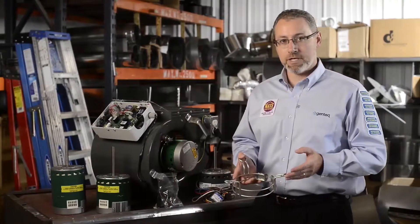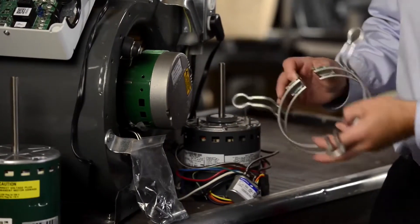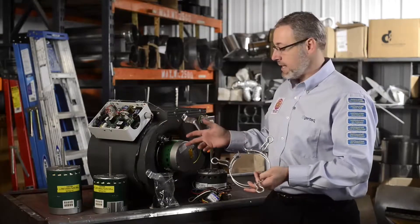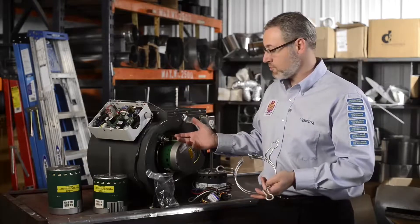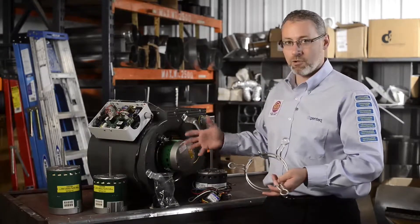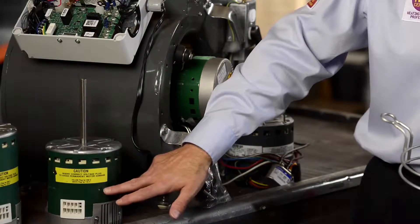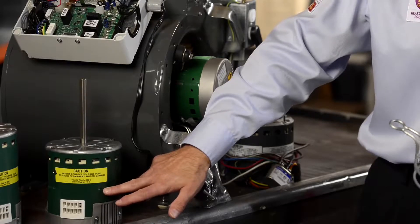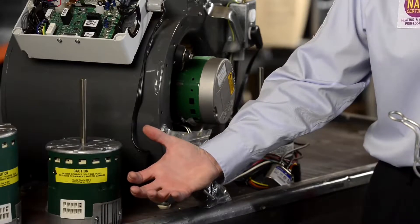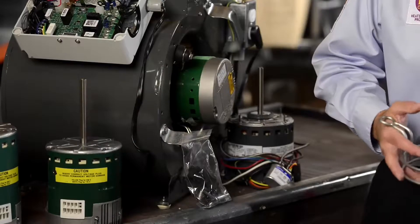After you've selected the motor mount, it's time to install it on the motor. It's unlikely that the bolt holes of the new motor mount will match the existing mount's bolt hole locations, so you're going to need to drill new holes. I strongly recommend using an actual bolt and nut — which our motor kits provide — rather than just a sheet metal screw, to ensure a secure long-term installation. We want to locate the motor mount between the vent holes in the shell and these dimples. These dimples locate the bottom of the stator stack, meaning below the dimples is the open area in the motor shell where the electronics portion exists. Keep the motor mount between the dimples and the motor vents, of course not covering the motor vents.